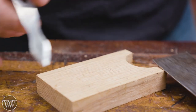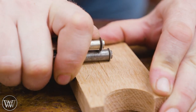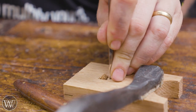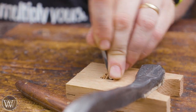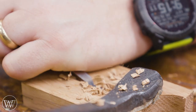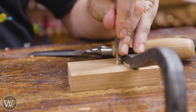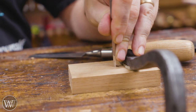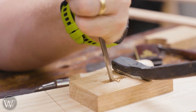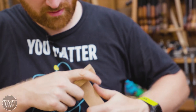I'm going to transfer those marks around to the other side so I can chop from both sides, just like a standard mortise, making sure that my lines line up from the marking gauge — that way I have the exact same measurement from one side to the other. I'm going to treat it just like a mortise except I'm not going to go really deep at the beginning; I'll go just a little bit past halfway on the first set, then flip it over and come at it from the other side. Follow the bevel of the chisel, stay away from your end lines as long as possible, and when it's all cleared out, go right down your end grain lines for a nice clean surface.